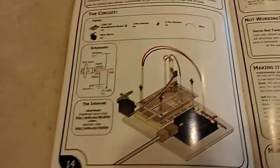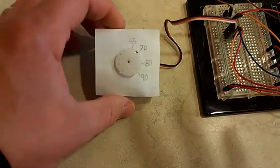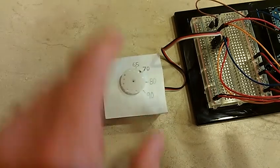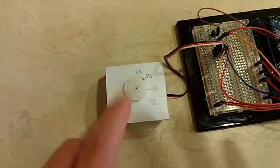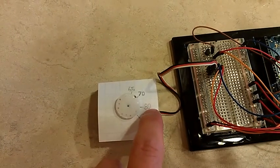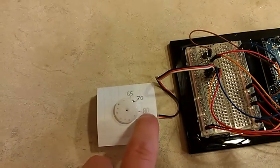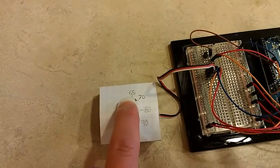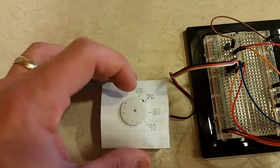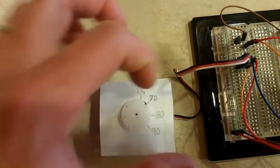It's a very simple sketch so it didn't take very long to make. I fabricated this dial using paper, the servo motor's inside, and I used my laptop to read the current temperature. When I used my body temperature to get up to 80 degrees, I'd make a mark in the paper — that was my calibration. I noticed it didn't seem linear going down to 65 compared to 80 to 70.